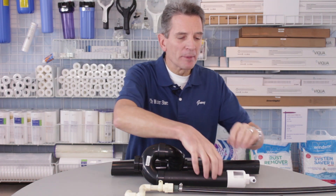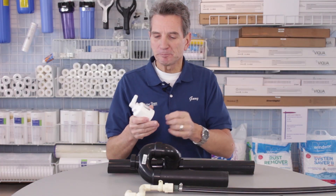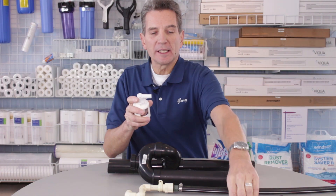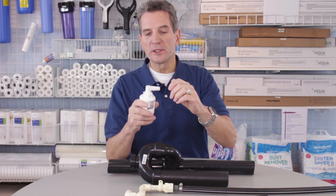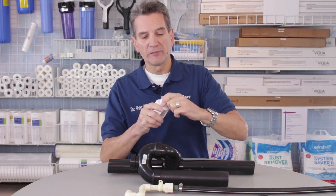You can also drain it to a special fitting that maintains an air gap. A special fitting would be one like this — an air gap fitting. This has a fitting on the top where the drain line gets connected, and once you've positioned it correctly this fitting would be glued in place. That's very important.